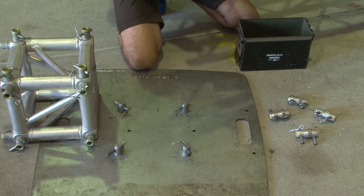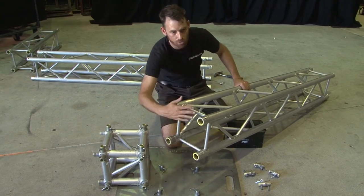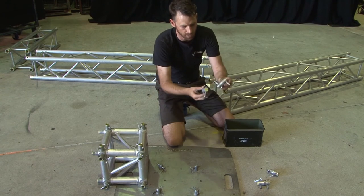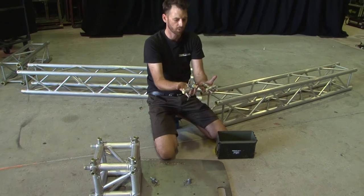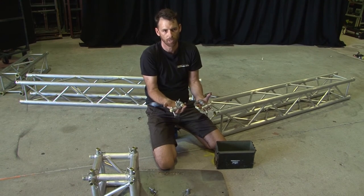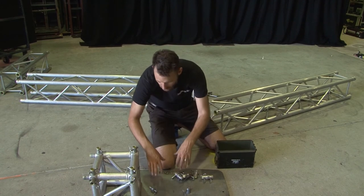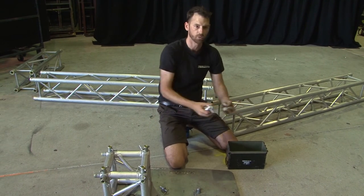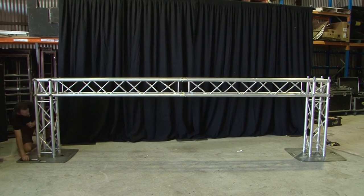And you'll see a pile of four of the spigots there. So what I've chosen to do here is to take the spigots completely out of the truss and put the pins and clips back in it, so that next time on the job, I can grab four of those spigots and know that the pins and clips are attached to it. And it's a quick little process to start building that job on the show, because we're really trying to save time on a job. Whereas if I had to rummage through that tin and find four spigots, then four pins at the bottom, then four clips, then I'd be probably taking 5 to 10 minutes per join, as opposed to 1 minute where I just grab my four spigots that are fully loaded with pins and clips and take it to my join of truss, drop it down, come along and join that truss together.